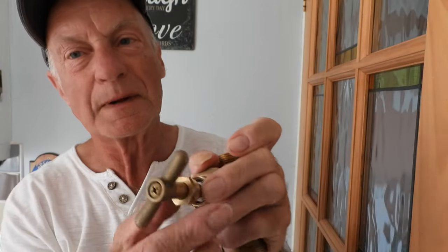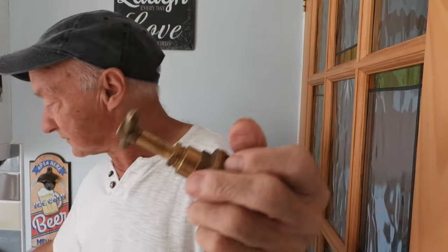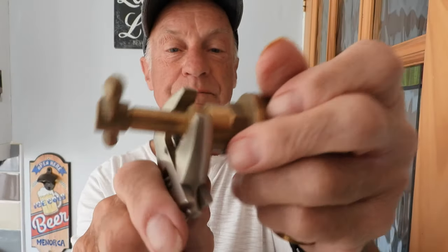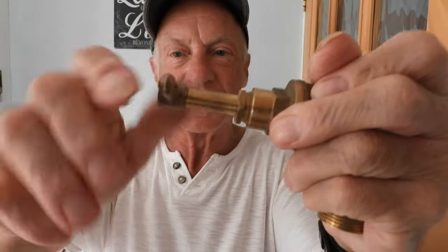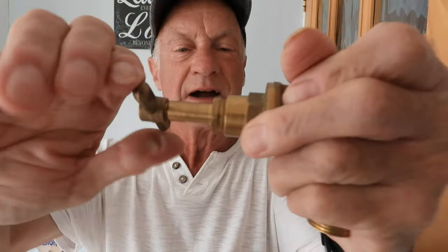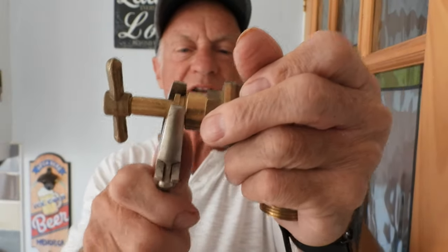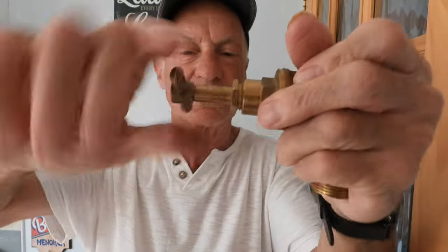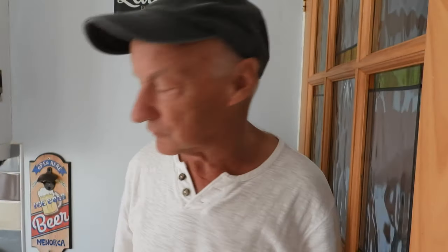Use about eight to ten inches of PTFE, then get your nut and push it on and start it up. Once it's started, put the spanner on and just nip it until it feels tightish but not too tight - you still want to be able to turn it. That's why we left it in the on position, so it's easy to turn and check for leaks. Turn it on and off a few times; if it's gone a little loose just give it a tad more. Try it a couple of times and it should be nice and dry. Simple easy fix - I hope that helps everyone, thanks for watching!